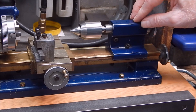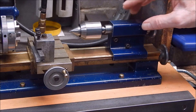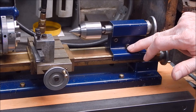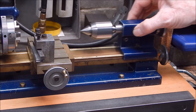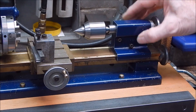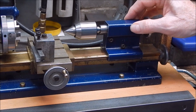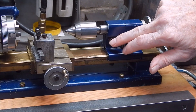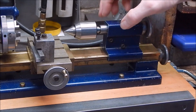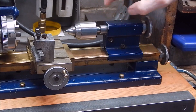And I was thinking, how can I get this thing accurate? But then I finally worked it out. What you do is loosen this bolt off here completely, and tighten this bolt here so that the tailstock will just slide up and down on the ways without binding — just slide up and down. Leave it — that's the critical thing. Then when you use it, you slide it up to your job, get it in position, and tighten this bolt up here. That actually locks the tailstock in position and takes out any slop in the tailstock quill. It doesn't actually lock the quill as such, but it takes out any slop.